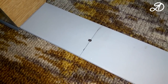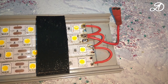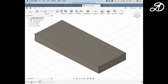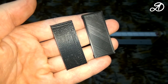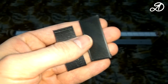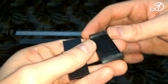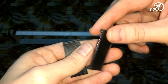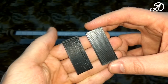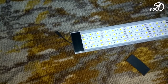For installation on the wall you can make slightly elongated holes so it's easy to level. To cover the wires I modeled a sliding plug for the profile. Printed two pieces: the left detail was printed on its side, the right one was printed with support with flat side up. It just snaps on and all wires are covered under it.